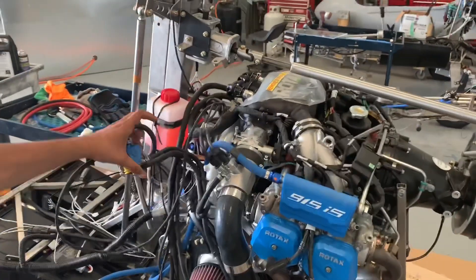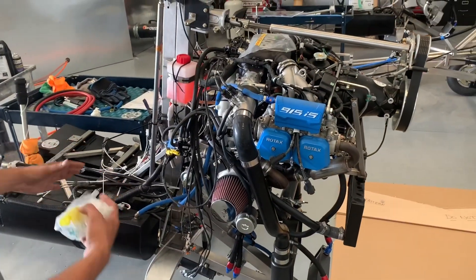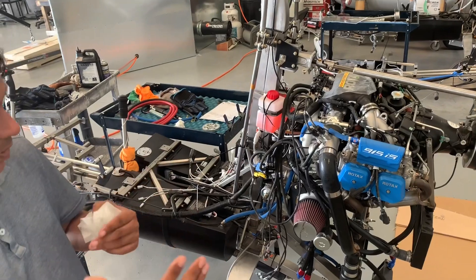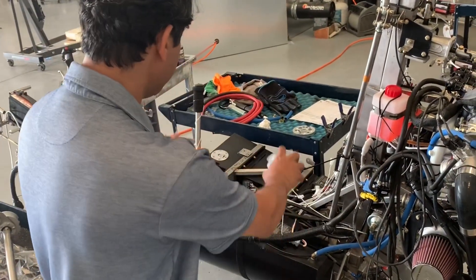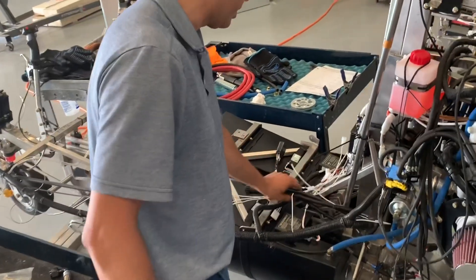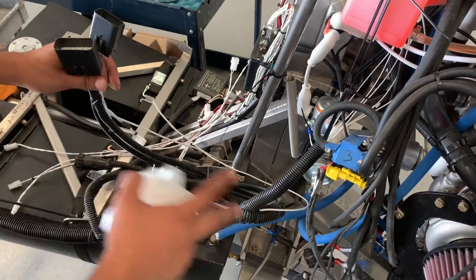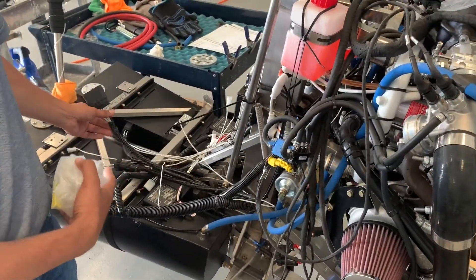There are a lot of things we are still installing, like this stuff right here — and there's a big fuse box that will all get installed against the body. When the body goes on — which is in paint right now, actually supposed to pick it up today — it will get installed on the body. There are places on the body that have actual installation of electronic components, because there's a big fuse box with the iS engines. There is a computer — an ECU, redundant ECU — that all gets installed on the body. That's why all these things are lying around, because only when they get installed can we finalize the wiring installation. These are the HIC connectors that come from Rotax. The wiring is done half from Rotax, and then the other half has to be done by the manufacturer — this will go into the fuse box and into the computers.